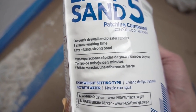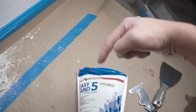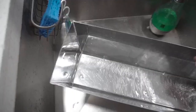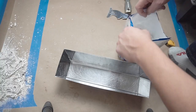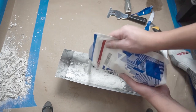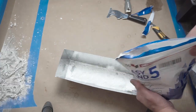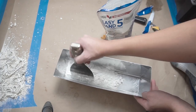I'm going to be using Easy Sand 5-minute joint compound. It has a chemical compound that makes it dry super fast and super hard — great for touch-up or patch repairs on drywall. I'll leave links in the description for where I got this and the tools I used. I'm putting water in the pan first, then applying the powder on top — that's good practice. I'm mixing a little bit more than needed because there's also that drywall crack on the side of the hole that I'll patch at the same time.